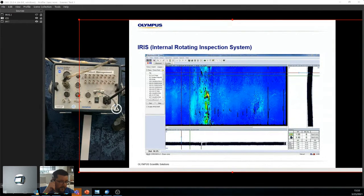I'm not sure what that material is, so we'll try and give a general example. And worst case scenario, I can talk to the person after for more information. So what would happen is, if your calibration tube, if you're able to build something identical and test it out, then you'll be fine. Because what happens when you put the probe in the material and you null, assuming that your liner is thin enough that there's penetration into the wall of the actual tube, you'll get an operation point, and that operation point will vary depending on what you're seeing.